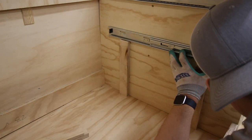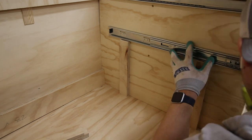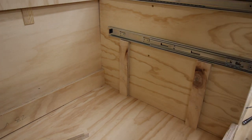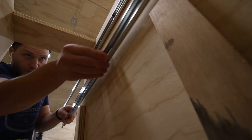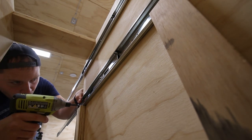With that little problem worked out, I could move on to installing the drawer slides for the upper cabinets. Per Jay's plans, I cut some scrap helper blocks at the appropriate heights for each of the three different drawer heights that would be used in the upper cabinets. The spacer blocks could then be used on all three upper cabinets to make sure that the drawers were installed at the same heights and thus even when all was said and done.